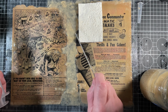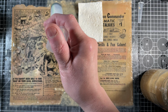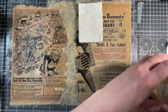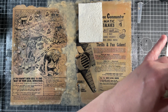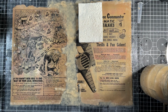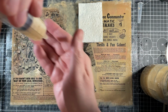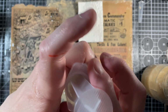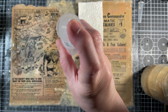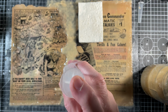So you can see that some areas are a little thin and some areas still need more. So we still have 23 mils to deliver. And I'm going to deliver them to the thinner areas, right? 23 mils. Is that 23? Oops, not sure if you can see it. Let me see it this way. That's 21. That's 22 or so. 22 is okay. We'll do 22 for now. And fill in these thinner areas, right? You have to overlap a little bit so you can get some adherence of the pulp.